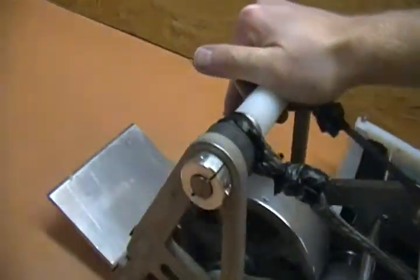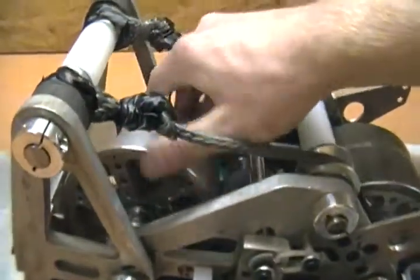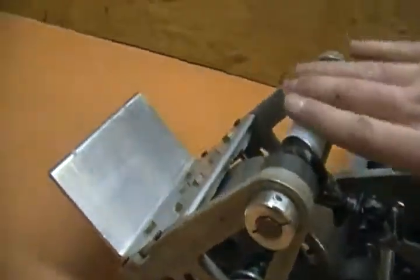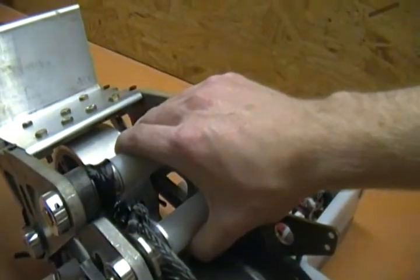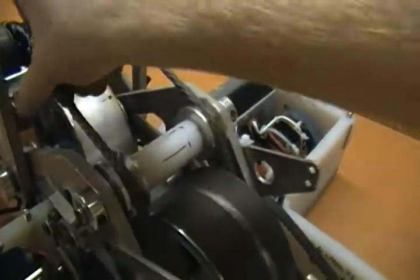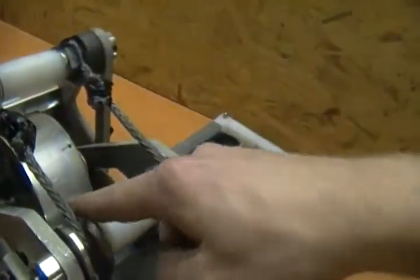When it starts, the flipper is all the way down and the coil is all the way out. Then as it rotates, it winds in the rope and causes the flipper to rotate up. When it hits the end of the stroke, these two big rubber stoppers make it so that it doesn't just break. The rope goes really, really tight, and you can see the bottom of the rope is actually getting pressed into almost a hard plastic from where it jams into the idlers up here.